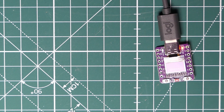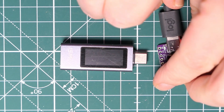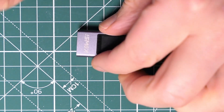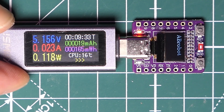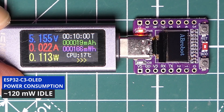The first thing I'm going to test is power consumption, so let's give that a go. I've got this USB power meter — let's plug this in. This is straight out of the packet. So there's only the screen being powered up at the moment. You can see the USB is providing around 5.1 volts and it's drawing 23 to 24 milliamps, with around 118 milliwatts powering this microcontroller. So roughly around 20 milliamps at 5 volts — it's a relatively low power device.